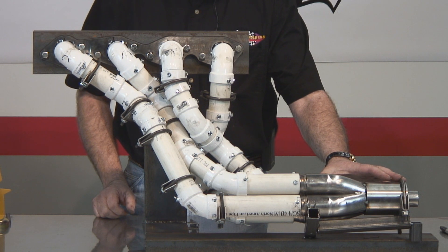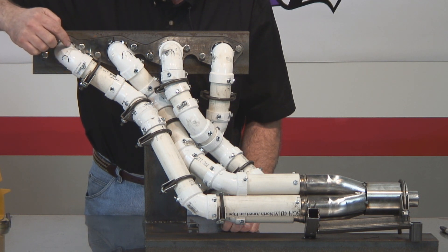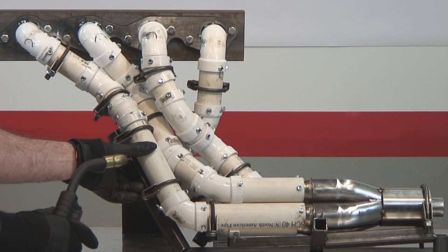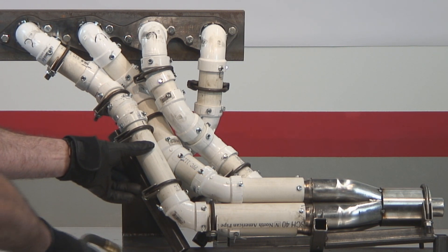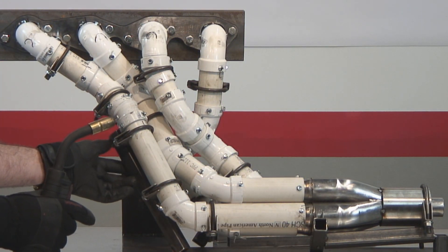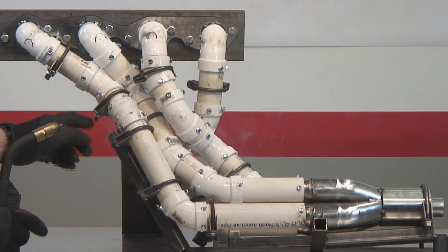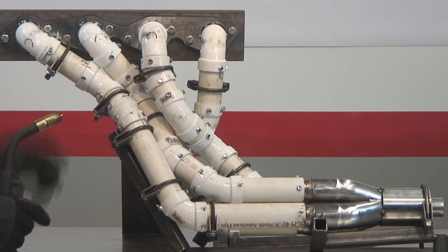The collector is also fastened into its permanent location. Notice the location of these clamps — they're in the straights. You can measure from the center line of the clamp to the center line of the radius to pick up dimensions that aid in fabrication. Something important to keep in mind: when you're tacking up a fixture built using PVC, your ground has to be followed through your tubes, or your ground clamp has to be put on the one-inch square tubing somewhere along the way. This particular one is grounded to the base fixture. We'll zip this one on, and that way we've got a ground as we work our way up to the next clamp.